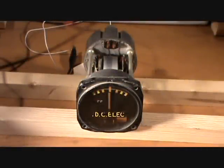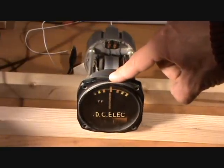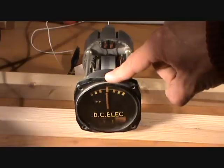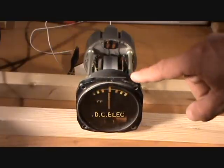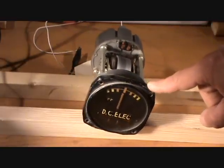With the gyro powered and operating in normal speed, we will rotate the indicator around all three axes to see the reaction of the gyro in every case. So, as you can see here, turning the indicator around the longitudinal axis, nothing happens and the pointer remains centered, or no turn indication. This movement corresponds to the airplane banking.